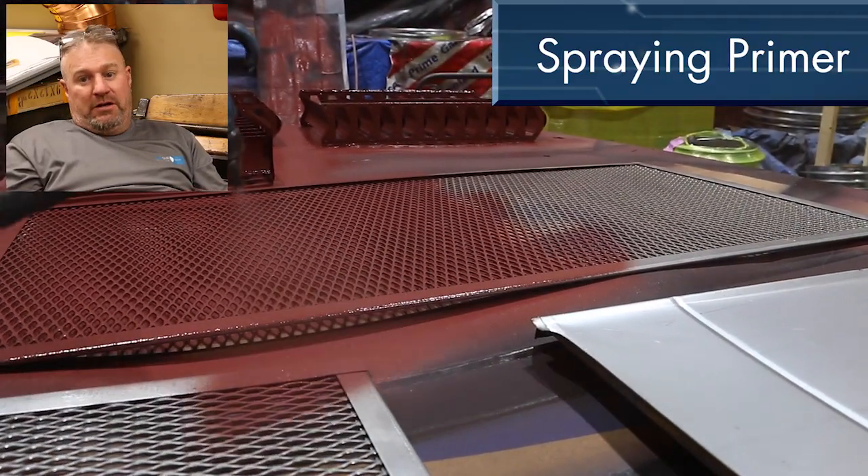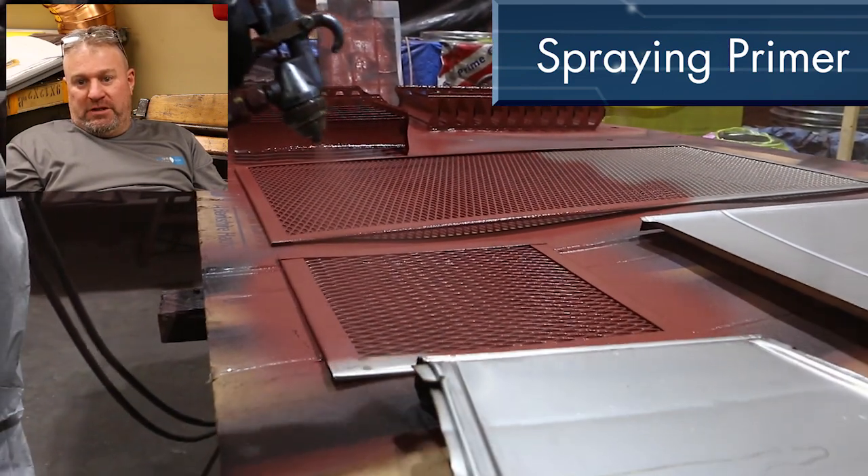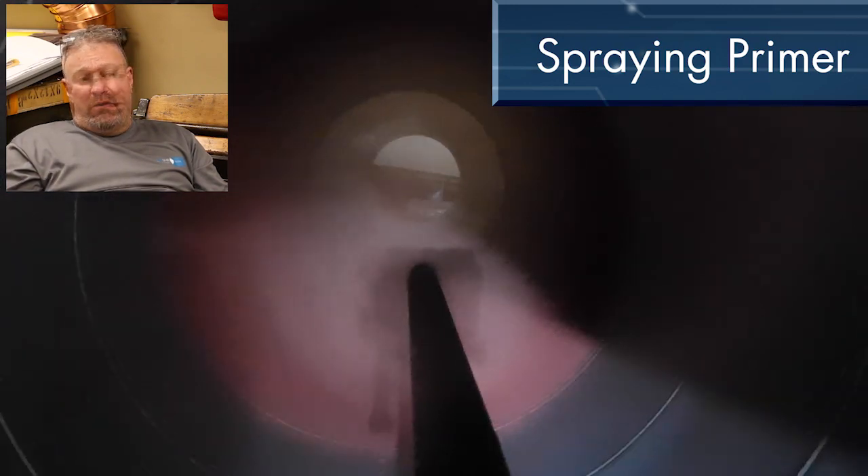You're still going to need to spray components — turning vanes, access doors, purchased items, volume dampers — anything that's not coated or made from that coil.